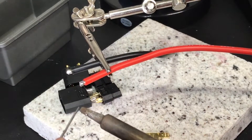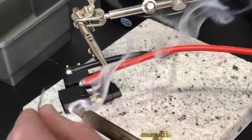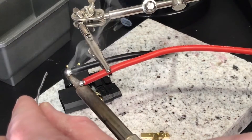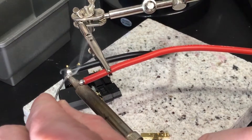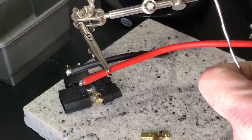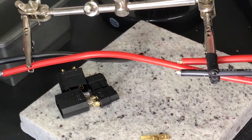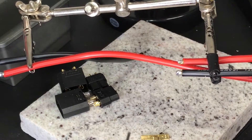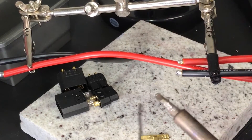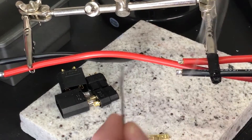Now that I've tinned the wires on the first side, I flip them over and tin the other side — it's much quicker because it's got fresh solder on it. That's important: you want an oxygen-free covering of the solder, not too much. Remember, you want to see the texture of the wire. I tend to over-solder, and I think that's pretty common, so go light on the solder — you only need a little bit.